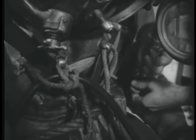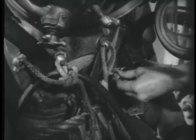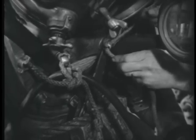At the same time, the other tender slips the control valve link bracket over the left lower stud and bolts it on tight, with the bracket extending in such a way as to put the control valve in position for the diver. He then fastens the hose to the left pad eye with the signal halyard.